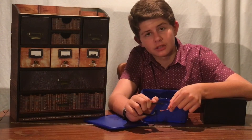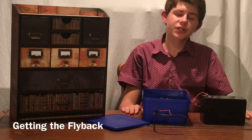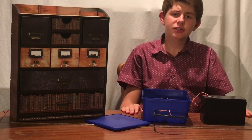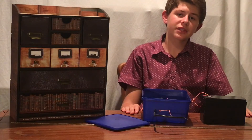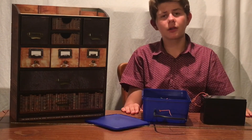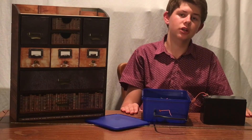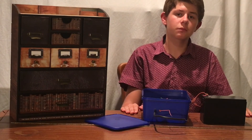So that's a lot and I really don't want to touch that. The flyback transformer was taken out of the television set, but to get that out I had to go through a few steps to short out the television set into the ground so I didn't get a lethal electric shock. I suggest you watch the video in the link in the description box below so that you can see how to get it out of the television set without getting shocked and to make the television set perfectly safe.